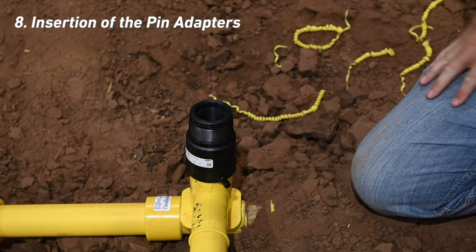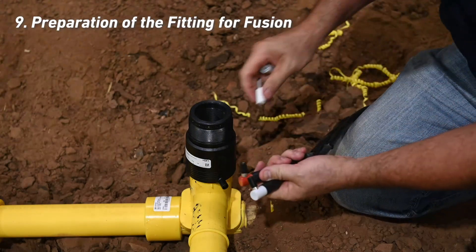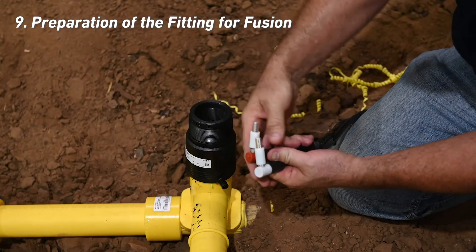After the fitting has been tested for gas pressure buildup, it's ready to be attached to the processor. If your processor has 4.0mm pins, it will fit onto the repair fitting's terminal pins. If your processor uses 4.7mm pins, as is typical for Central Plastics processors and fittings, you'll need the 4.7mm to 4.0mm adapters provided in your tool kit. Simply press these over the 4.7mm tips of your lead, and you're ready to turn your attention to the processor.